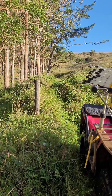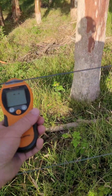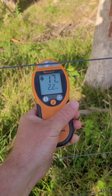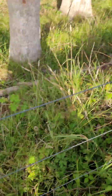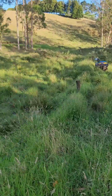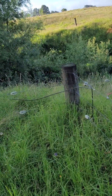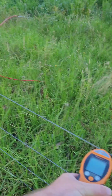Having driven over a really dangerous mound I didn't realize was there, I can retest after it to see if the amperage has changed. Still 17 on top, still 20 on bottom. So as much as that greenery looks like a real disaster, it's not doing anything. I made it to the end of the paddock — more difficult than it should have been — and you can see here there's a junction, so it's good to start testing here and see which way the leak goes.